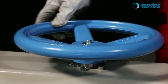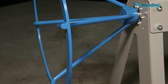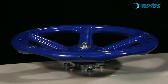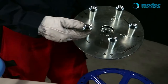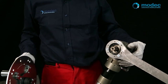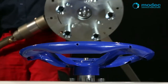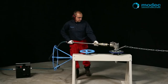Now you need to select the right adapter for the device that's going to be rotated. This choice depends entirely on the shape of the hand wheel and how easy it is to access. For flat or slightly tapered hand wheels, you have the choice of several different adapters. The fixed universal spoke adapter is a drive plate to which you can fix from three to five fingers according to the number of spokes on the wheel. The adapter fixes onto the hand wheel itself, so with one single adapter you're able to activate pretty much any flat or mildly tapered hand wheel.